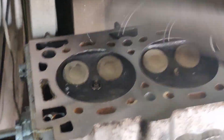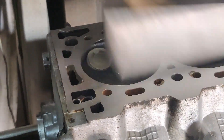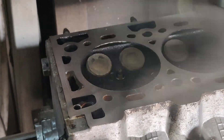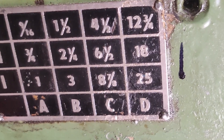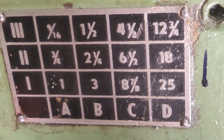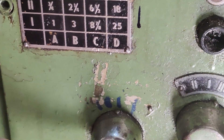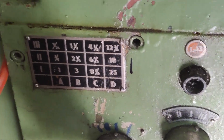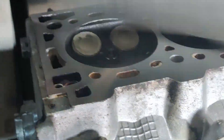So we'll do a finer clean-up pass in the backwards direction. I'll change the gearbox settings — remember if we're on 12 and three quarters we'll have to change it to 4 and a half, which is this lever. And now we'll take the slow drive back.